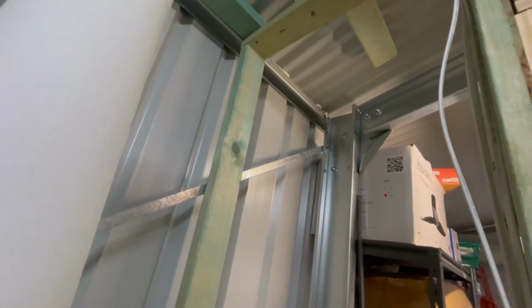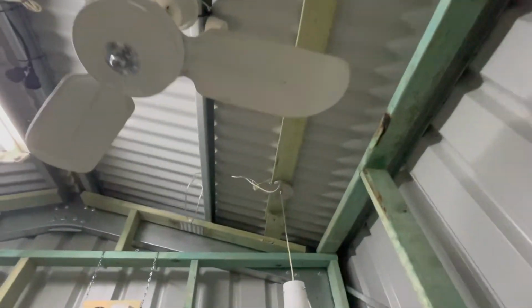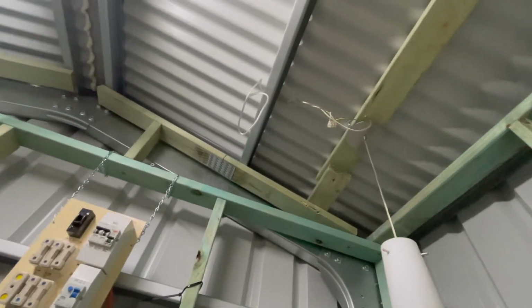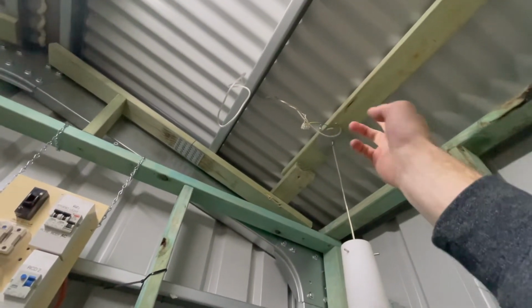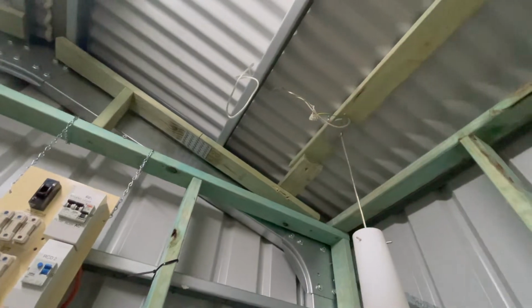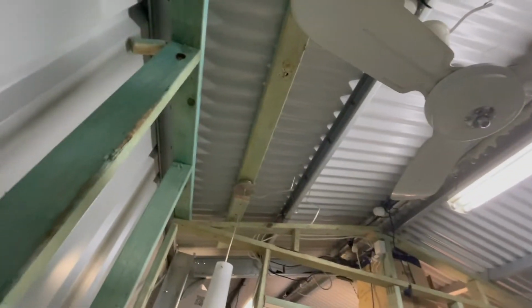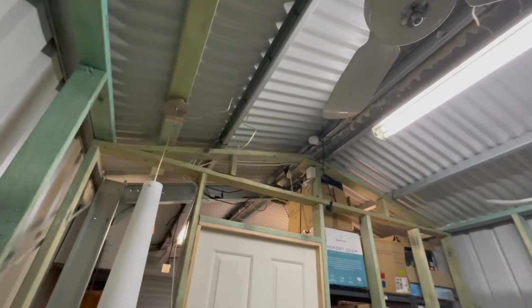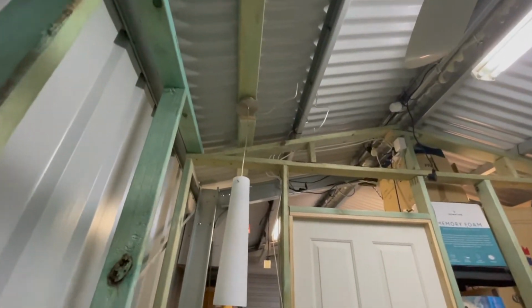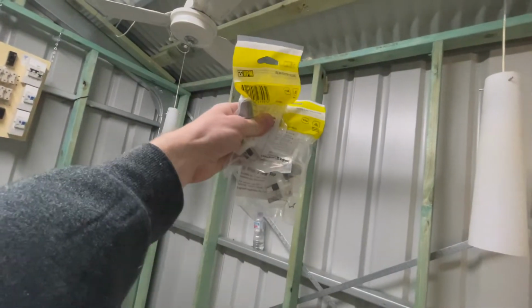But I'm not going to do that because there's a bunch of cable left over on these still from whenever they originally installed them. This one's got longer cable. So I'm just going to take the earth out of that connector block, take the connector block off, and just put the plug on the end of the cable. Wire up the plug base, probably at that one there, just going back to that junction box, because that's all it'll need. And then we might be able to get these pendants working tonight, which would be nice. They won't be dimmable, but they'll be working. These 2 pendants, these 2 plugs.